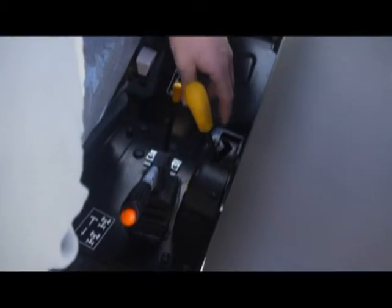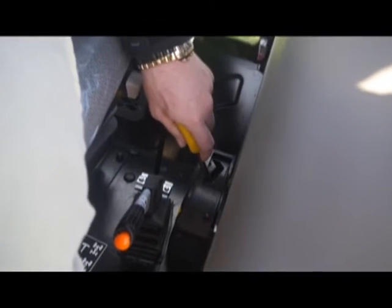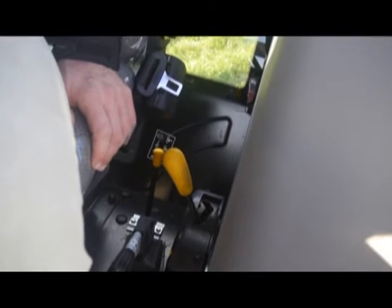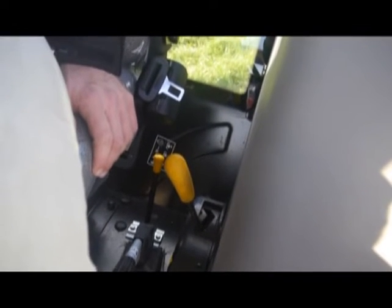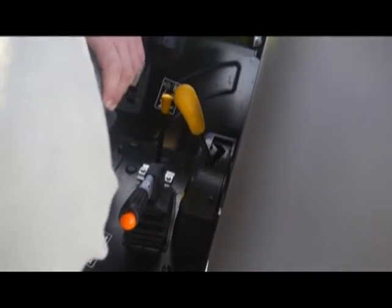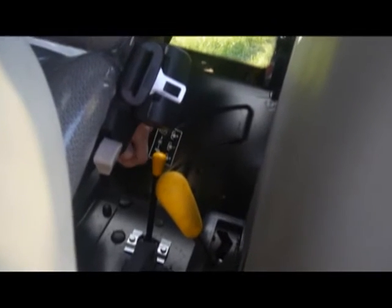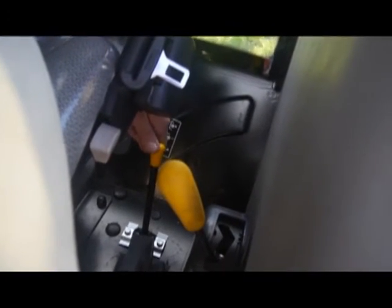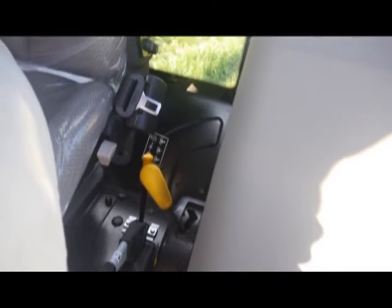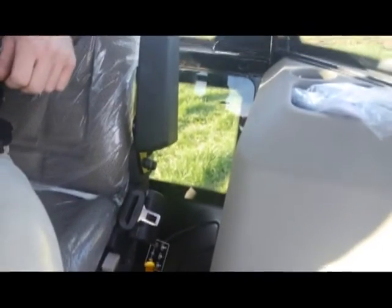Back over here, you've still got a PTO clutch, so that engages the PTO. On the back of the tractor is your 540, 1000 spline speed selection, so that's just a lever that you pull up and down, on the outside of the tractor. And over here, this little lever is whether it's engine based PTO or ground speed based PTO. So a couple of little features there. Again, very basic mechanical feel about it, but it still works well.